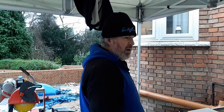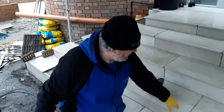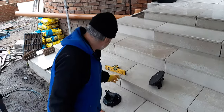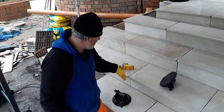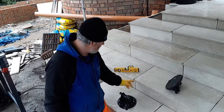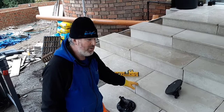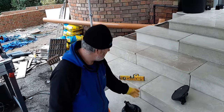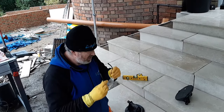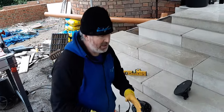We'll show you how to lay one. On these slabs there's a corner that doesn't come to a right angle — it comes to a curve. When you cut one side you end up with a straight right angle, so we've had to put the curved corner on ourselves. The good thing is these slabs are full-bodied, meaning if you cut the porcelain it's the same colour all the way through. These are white throughout, so the cut edge matches. If they were cheap porcelain with a black inside and white on the outside, we wouldn't have been able to do the corners like this.